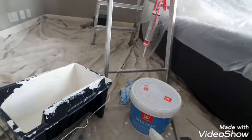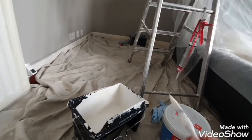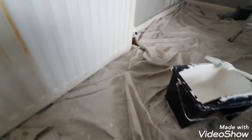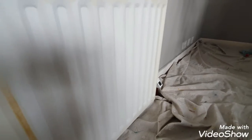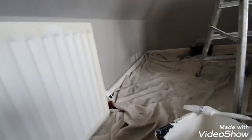This is interior only. For exterior, it's just Otex which is solvent-based, or you can go water-based exterior with Tickerilla — that's called Ultra Primer, their water-based exterior etch. So yeah, I'm going to carry on and get the whole room done. One coat of this, then two coats of the Evo Aqua.